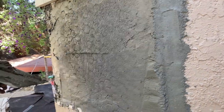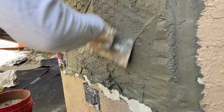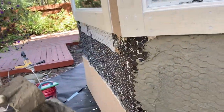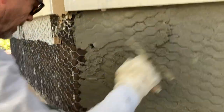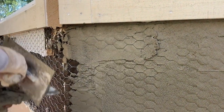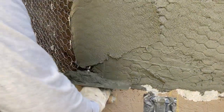Just remember we've got to get to another job. Let's go around the corner over here JR, and pick this corner up here. You've got to keep on filling - fill that up there, you're going to have a problem on brown coat. You've got to get it on the scratch coat.